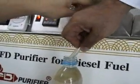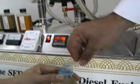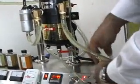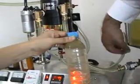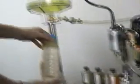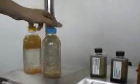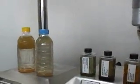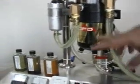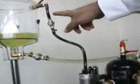That's when you know that there's no more water left in the system, so we close it. In normal circumstances, the drain valve should be able to continue and start again. You can see from this bottle that the water has been recaptured into this bottle. All the water that we put in here actually came back. Nothing went to the engine side.